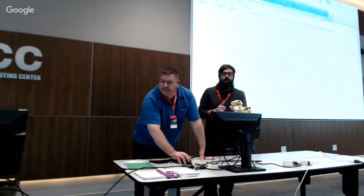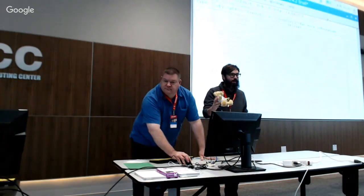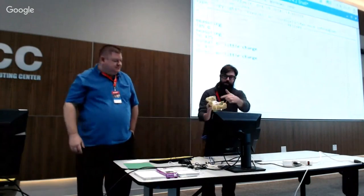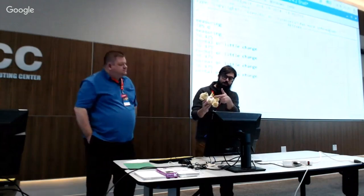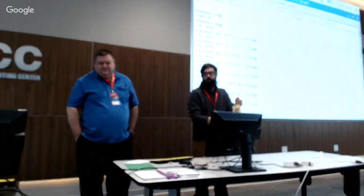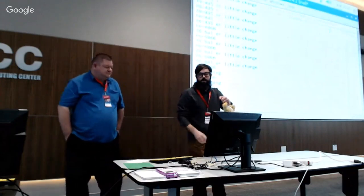Oh, awesome. Okay, so basically we started out with the idea that it would be a great way for kids to have a checkup in school. Instead of going to the nurse, you could send them out to Doc Babbage and take their temperature and pulse. He's got a temperature sensor and 3 LEDs. When it's checking and the temperature isn't changing, it's green, and once it starts to change, you should see it change to measuring, and then the light goes on until he hits the threshold.